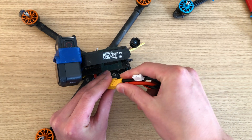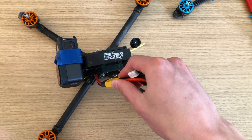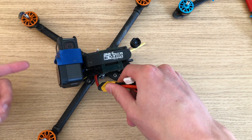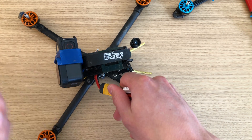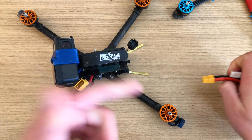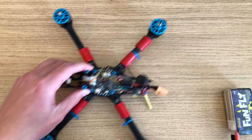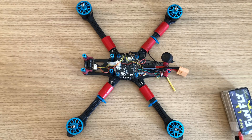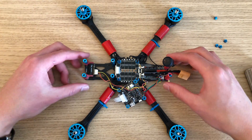We're going to plug this in and see if it makes any beeps. If it does, that's another indicator that the ESC on our problematic drone has some kind of issue. You get the initialization beeps, but not the second set of beeps, which I guess means that the flight controller is sending a signal to the ESC. So that's another indicator that the ESC on this problematic drone is having some kind of issue. At this point, the prime suspect is the ESC.